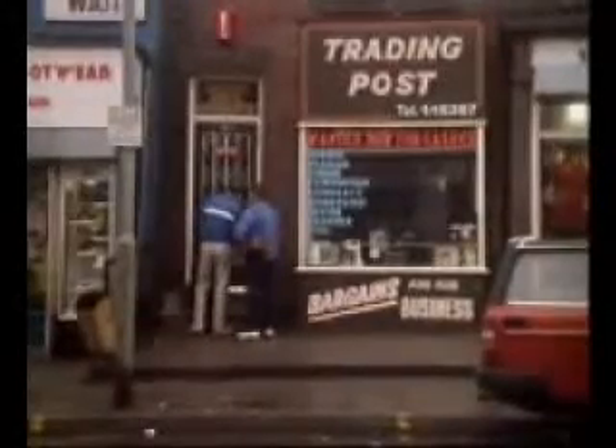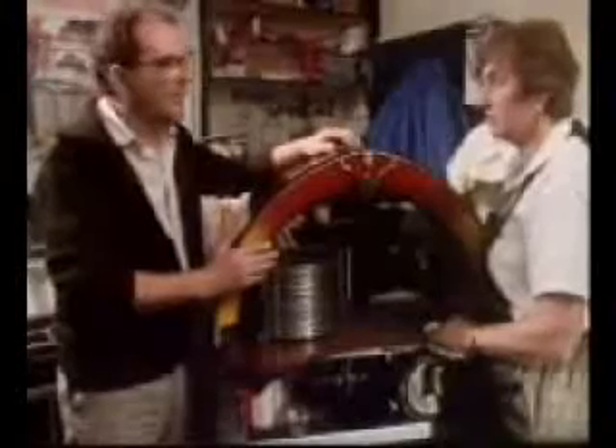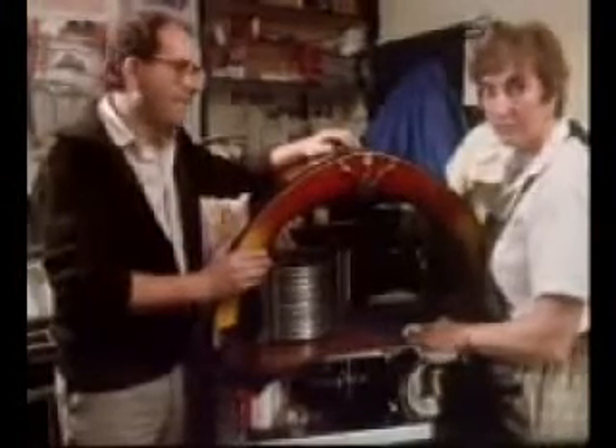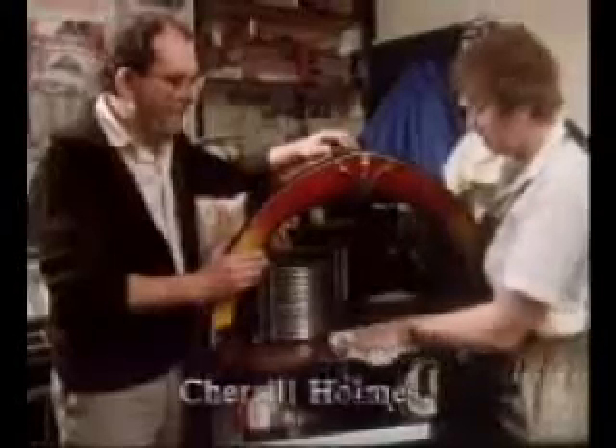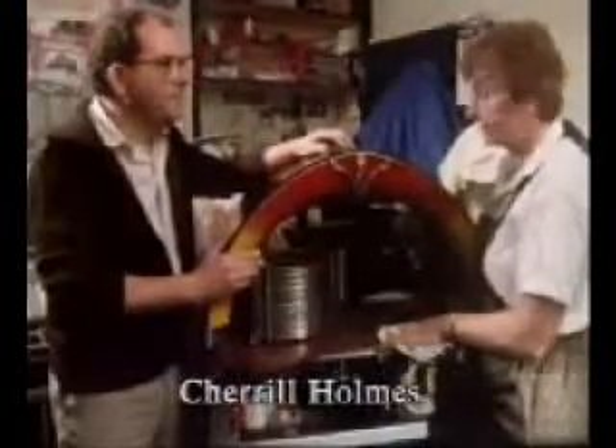This is the workshop where we do most of our restoration work, and this 1100 is the machine we are currently doing at the moment. Carol's been doing the cabinet. It had all been painted — we stripped all the paint back to the original finish. We've restained it, lacquered it, and now we're hand waxing it.